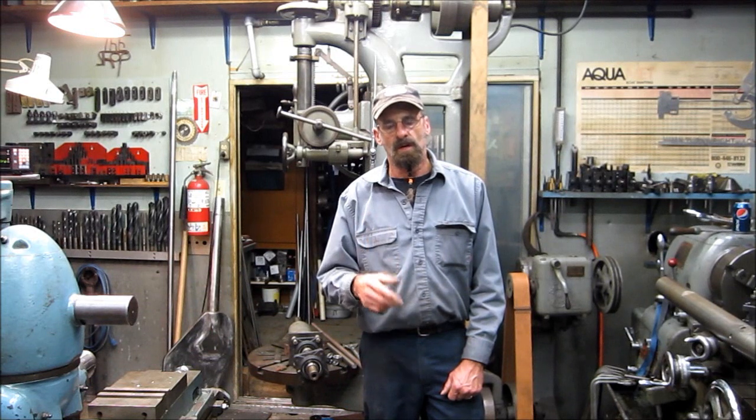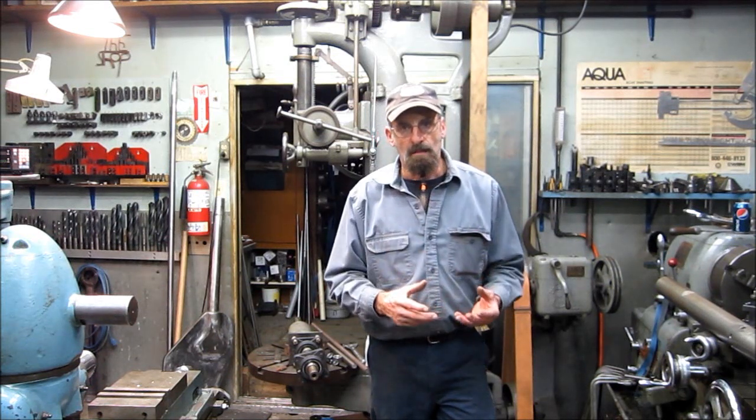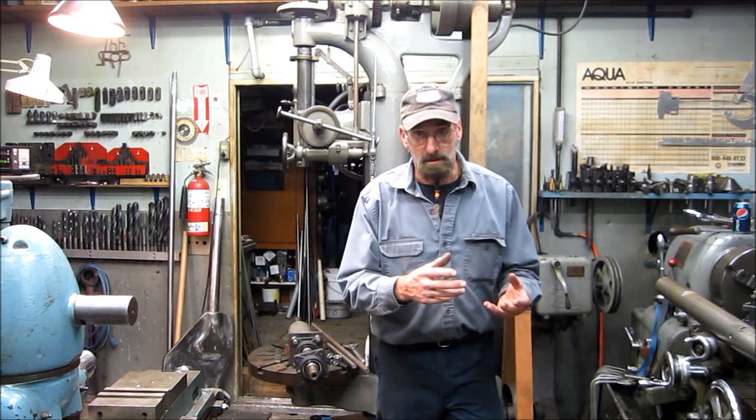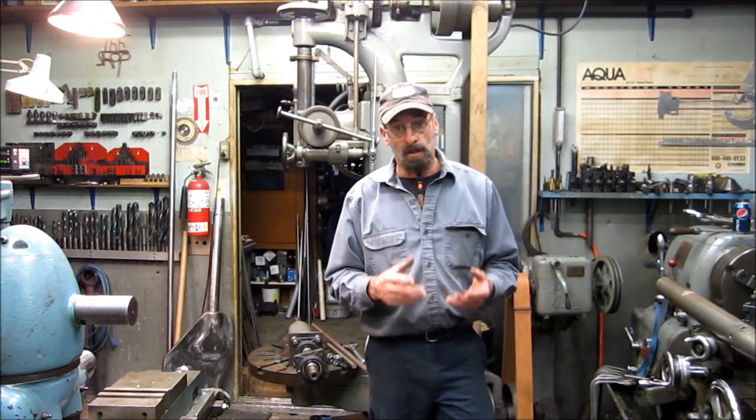Now here's a slideshow going through and showing you the excavator job I did, and you can see it's going to go through showing all the cracks that were in the thumb section of the excavator, which the thing was totally beat, and it kind of shows you how people will weld on top of weld on top of weld on top of weld, if you believe that or not. You look in the pictures there, and when something starts breaking apart, you've got to get in there and you've got to get down and cut out all the break.